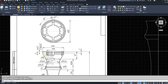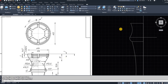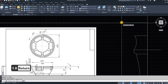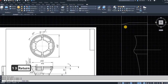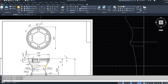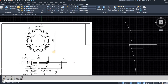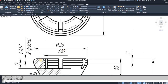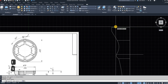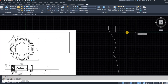The next thing is going to be a straight line. To get that, we have to start by drawing the total height of the piece. From this line we can go up about 10 millimeters to get the total height, then come across 13, go down 3, and there you have that line without using the angles shown. The width of the top piece is going to be 26 minus 16, so it's 10, meaning 5 for each side. So the width is 5 — we come across with 5, go down 5 as well since the depth is shown as 5, and then come across again.